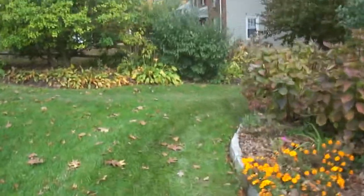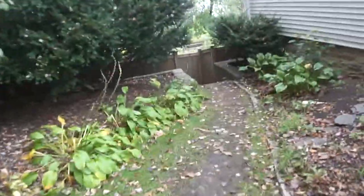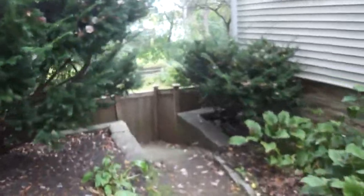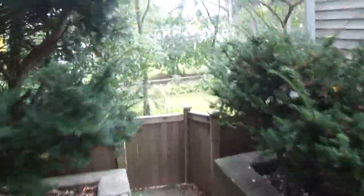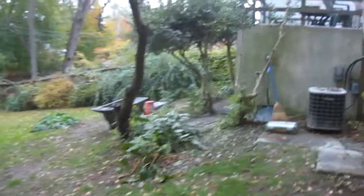Now let me show you the porch. The problem with the porch is it's uneven. It had the mantles in it but the blocks were disintegrating on the side, so the whole top block or slab of the porch was leaning towards where the concrete blocks disintegrated. And we had a water problem — a water erosion problem.